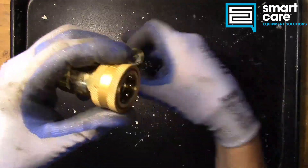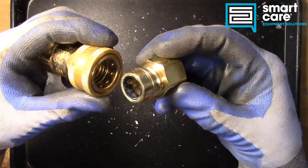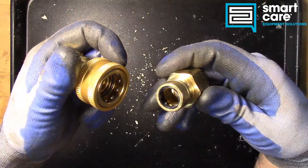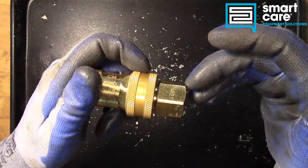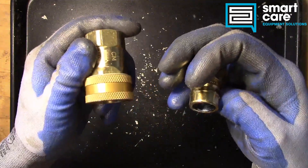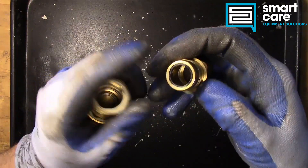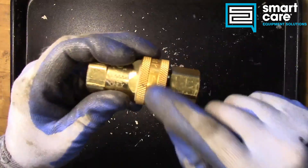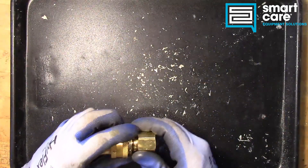When you have a piece of equipment, you may have this on the hose or on the piece of equipment, and you put these two pieces together. So you have no gas flow like this — put these two pieces together and now you have gas flow. There are some safety features built into this as well. In particular, there's this ring in here where if this entire assembly were to get so hot that that plastic could melt, the gas flow through this coupler would stop.